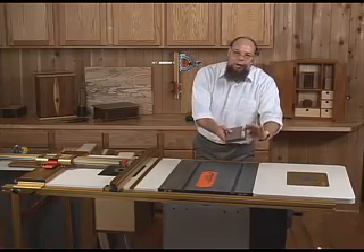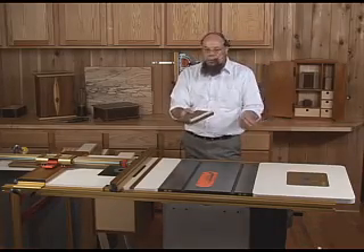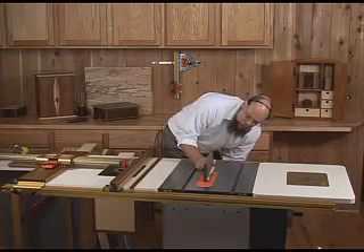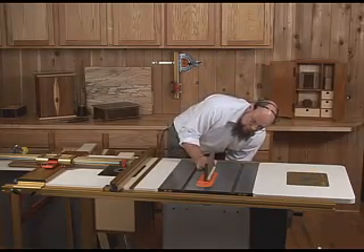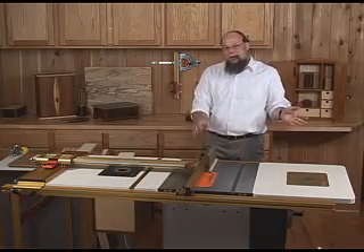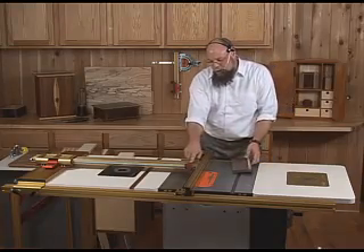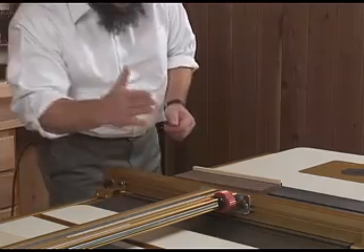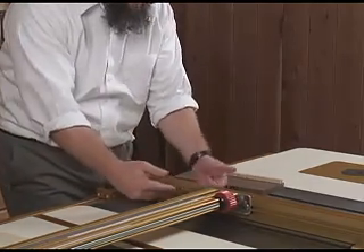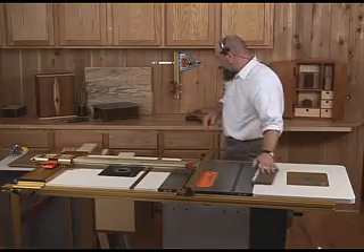The right way to bring this poplar down flush with the walnut is to use a hand plane or push it through a thickness planer, neither of which I happen to have close by. So what we're going to do here at the saw is essentially trim away everything we don't need — the closer the better, because nobody really enjoys sanding. The micro-adjust is perfect for those jobs because it allows you to sneak up on that one perfect fence setup with ten times the control, and there's no question that's a huge step in the right direction.